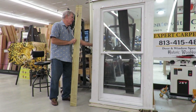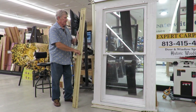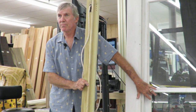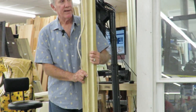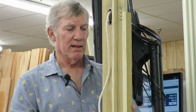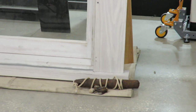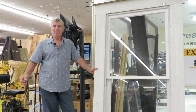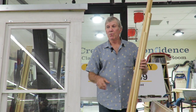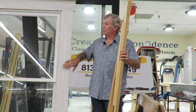The jamb consists of a window jamb and a piece of parting stop, which separates the upper sash from the lower sash. On the outside we have an exterior stop — just a piece of 1x2. The windows are counterbalanced with window weights, and this rope attaches to the side of the sash. When I get to somebody's house, they're usually painted shut. Once you get the sashes out, it's not very difficult to get into the weight cavity.